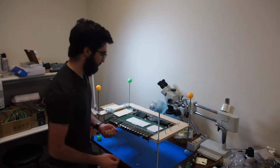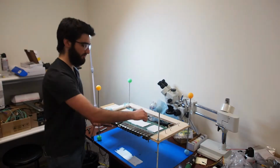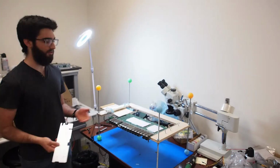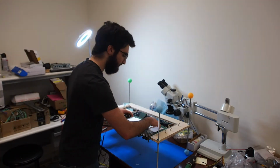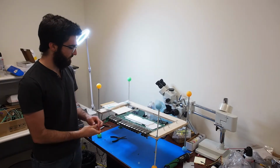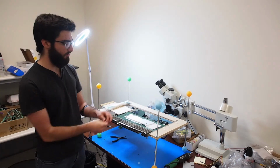The card assembly process involves attaching a heatsink to both sides of the PCB. The heatsinks are separated from the PCB with spacers off of each side, and nuts hold the assembly captive from one side. This is problematic because when the components for one side of the PCB are placed on the board, they need to be held in position while the PCB is flipped upside down to place the components on the other side.